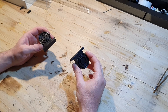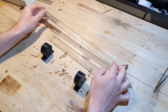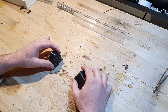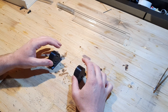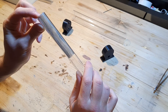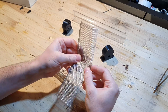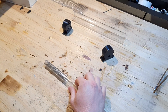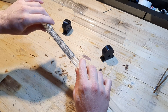I 3D printed these two parts here. Their main function is to hold two tubes — of course I will shorten these tubes. To generate ozone from oxygen, you basically need a continuous corona discharge, and to achieve this I'm going to use a glass tube. Inside this glass tube there is a metal mesh — just a piece I cut out from this metal wire mesh. It's stainless steel, made to protect you from flies and other insects. One part of this wire mesh goes inside the glass tube and the other one goes around the glass tube.